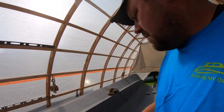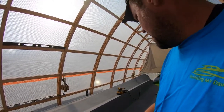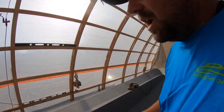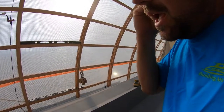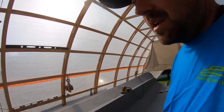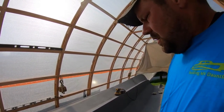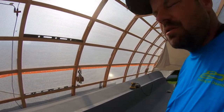Unfortunately it's taking way longer than expected to sand. I'm going to drop back to 120 grit to start — hopefully that knocks down the orange peel — and then step up quickly from 120 to 220 to 320 and we're ready to go. We did a couple test patches and I burned through in one spot. We've contacted a few people and the consensus is: sand it down and touch up where needed. Here's some more glorious sanding — thanks for watching, be sure to like, share, and subscribe.